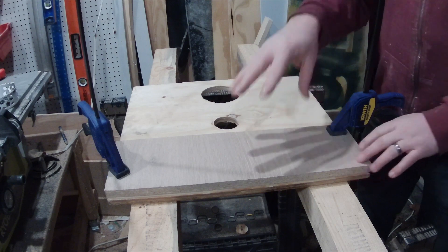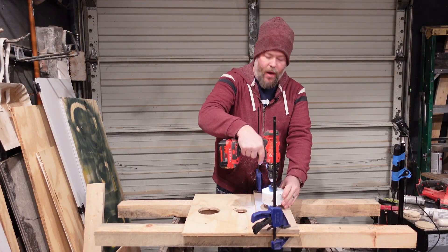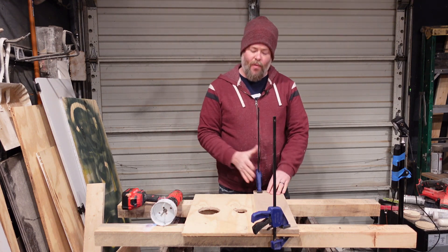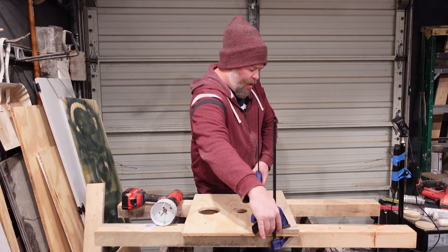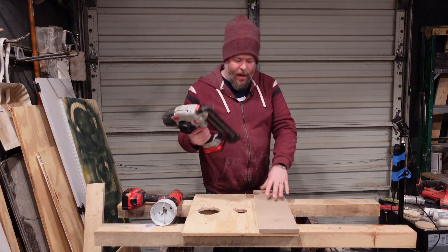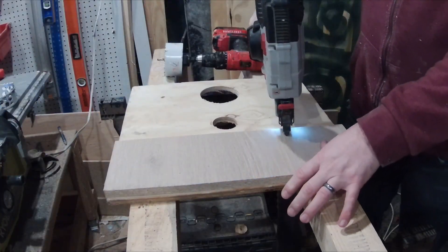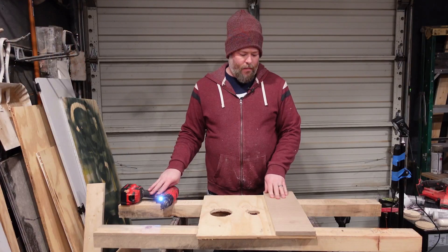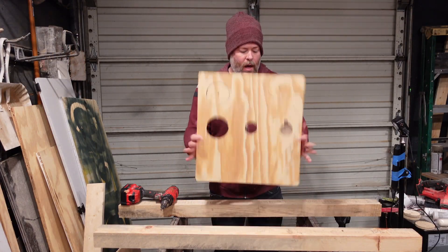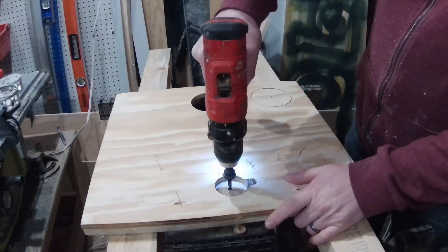Then you have a spot right here where you can actually just get your hole saw, go into your workpiece right over the hole, and start drilling that way. The issue you might run into though is maybe you don't have a way to clamp down here. The other thing you can do instead of using clamps is use a pin nailer or a brad nailer, and just shoot this thing down. So now you can drill from this side, or you can flip the project over. If you have no idea where you're going to be drilling from, you'll want to mark the hole.